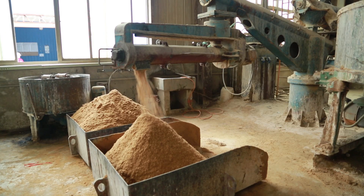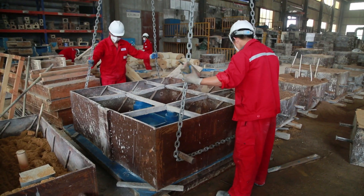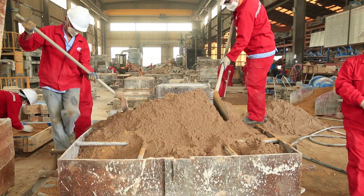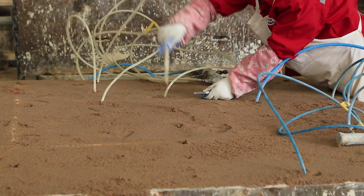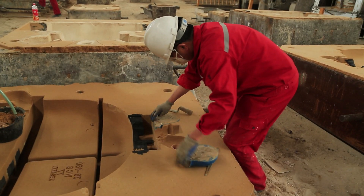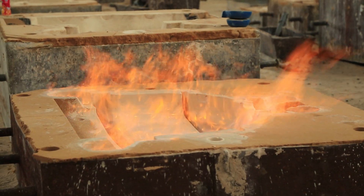In the Sand Cast Foundry, as described earlier, the sand cast operation consists of patterns and sand molds. What you are seeing is a placement of the wood pattern into the box. Virgin sand is then packed around the mold, and we use reclaimed sand from our knockout area for the backup sand. The box is packed and tamped. We use carbon dioxide injected into the sand to dry and set it. Once the sand is set, the wood pattern is removed and the box now has a negative of the pattern. We apply a special coating on the sand and burn off any organics, which helps the sand resist washing out during the pouring process.